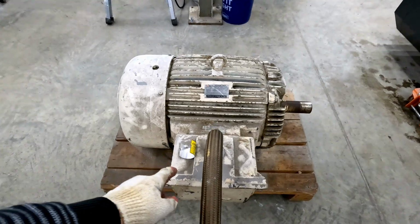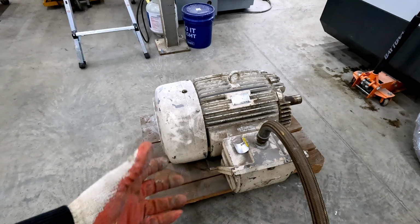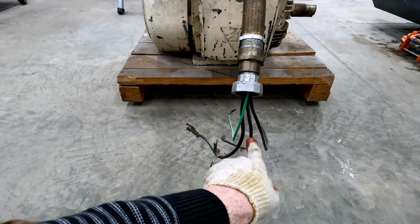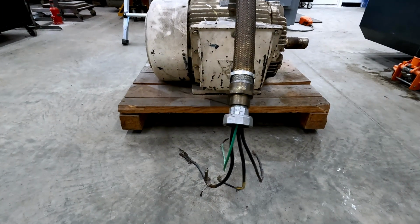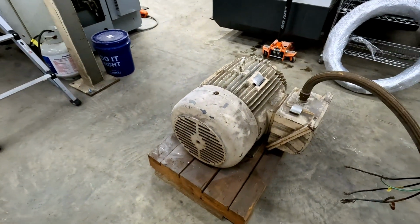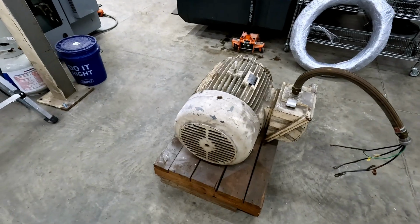You see, although you can run a 3-phase motor on 2 phases, trying to start a 3-phase motor on 2 phases is quite a bit more challenging. The most common approach is to use what's known as a capacitor start system. By taking 2 of your leads of single-phase power and applying it to your 3rd lead across a capacitor, you're able to, let's say, jump start the motor. A pretty good way to do things on a small motor, something say 56C size or in this realm. But for a large motor like this, the current drawn at startup would not only probably blow my local transformer, but my neighbors would know about it. And that's something I don't want them to know about.